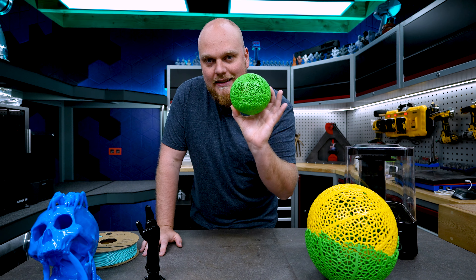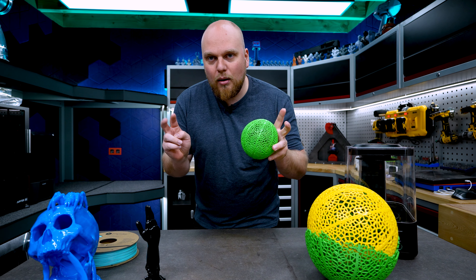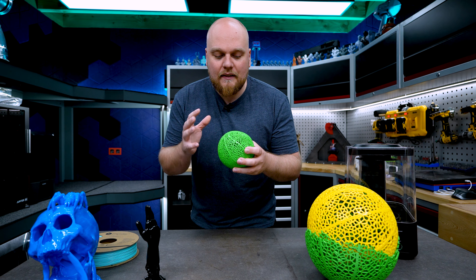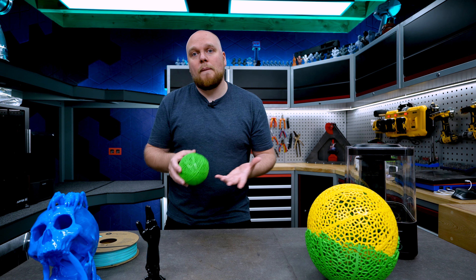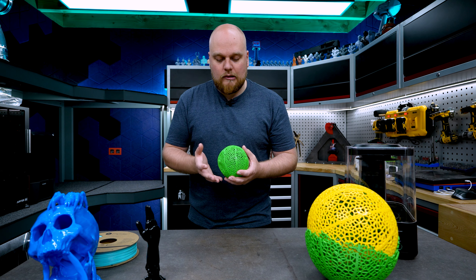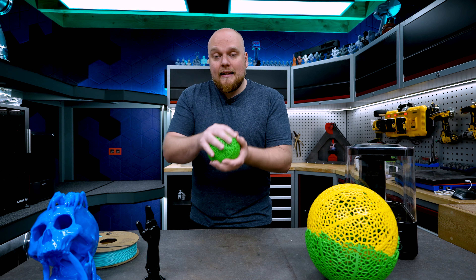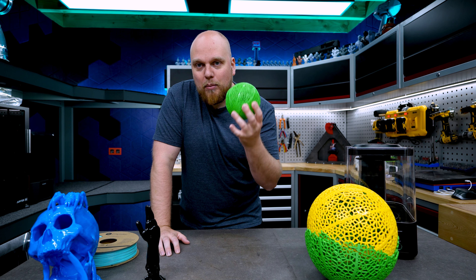This means that the design of this ball is actually pretty important, and this is something the official ball is probably doing right: getting a thin structure, not too thick, and using a material that is very much between flexible and sturdy. From the results by 3D Printing Nerd and Uncle Jesse, materials that are super hard bounce really well, while materials that are not very hard and more on the TPU side act like a dead blow. It looks like PVB is something in between, and I think if we scale this up with a very thin structure we actually have a ball that works.